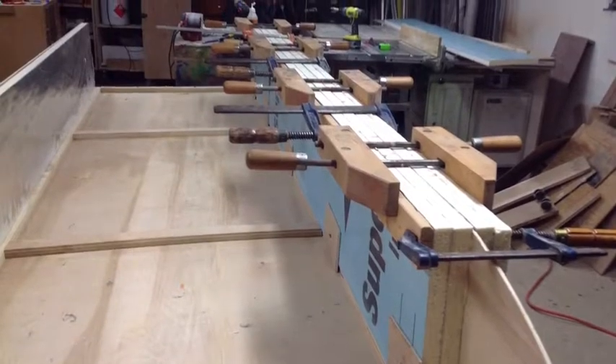I'll post the link so you guys can check it out. The wood glue is very reasonable. I strongly normally use Titebond or Elmer's — we have plenty of Titebond around, and it's an excellent product. It dries hard, whereas Elmer's wood glue dries a little softer. The difference is when sanding — Titebond is probably easier to sand because it doesn't gum up when it heats up. Anyway, that's my take on glues. Using the right glue for the right thing could be the formula for success.